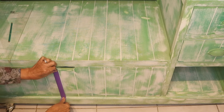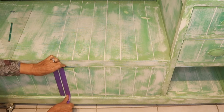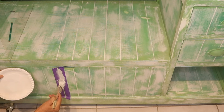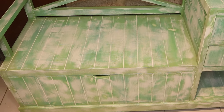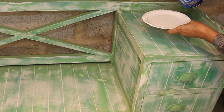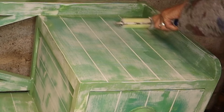On this part there are already grooves, so I am just sticking the tape on their edges and painting white inside the grooves. I am covering it with water-based varnish. I will apply two or three coats of it because it is a bench and will be used a lot.